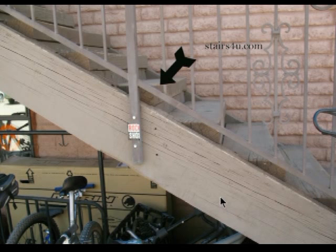I'd like to suggest one way that you could fix this. You could simply add a 2x4 to the top of the stair stringer — it would go on top and run diagonally at an angle, and you could put some plywood trim around it or a piece of trim to make it look like it belonged. That would be one way to fix something like this if you had a property you were thinking about purchasing with a stairway like this.